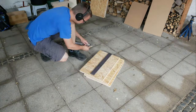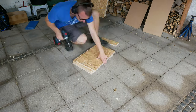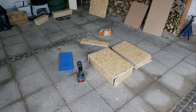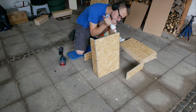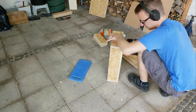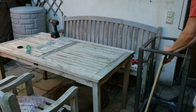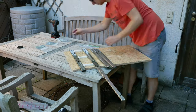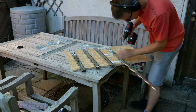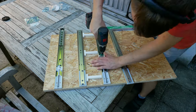The drill press stand frame is pretty much finished, so I made the drawers for it. I used these cheap wood boards because they are cheap and reasonably good quality - it's a very easy way to make drawers, just screwing them together with some glue, and then they are very solid. To mount the sliders for the drawers, I aligned the first one with the drawer so it fits well, then used printed spacer pieces so every drawer has the same distance. It's a very easy way to mount the drawer sliders - just put in the spacers, push against them, and screw it down.